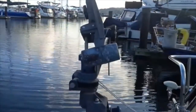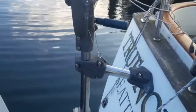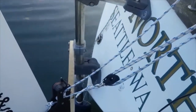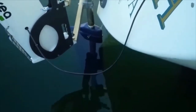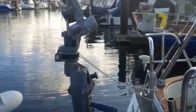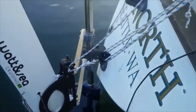So it's an exceptionally clever design, really super compact, with no running lines into the cockpit. Just one last angle here - this thing is set now on a beam reach, pointing on a starboard tack, and the mounting onto the back of the transom. This one is mounted center in behind the rudder. You can also do it offset. On my other boat it was offset because I had a stern tiller, and I had it mounted slightly offset about 12 inches.